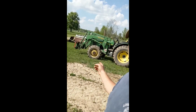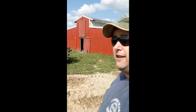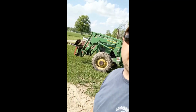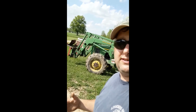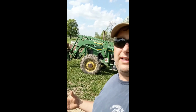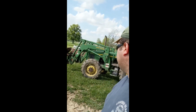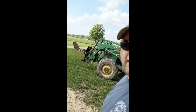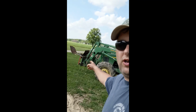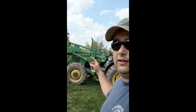We're able to get the stands put on the loader so that we could take the loader off. The advantage of doing that is, when you're working in the field, especially with hay and this equipment, the disc mower allows us to get into some of these small spaces, and we wanted to make sure that we weren't being restricted. You can see how the loader sticks out so far. It's got the bale spear on it now, but it really does stick out there quite a ways. So we can pull this whole loader right off the tractor, and the stands will hold it up.